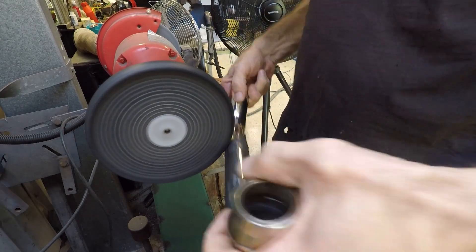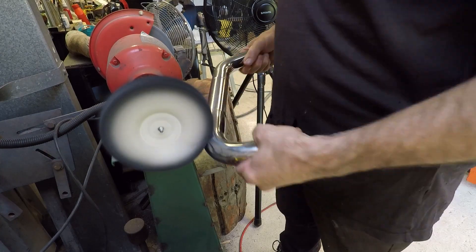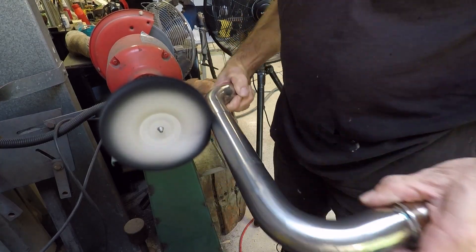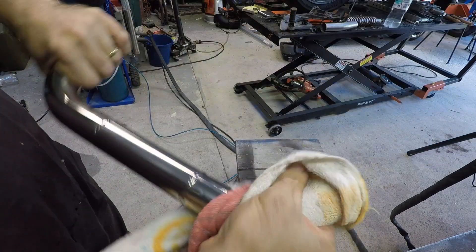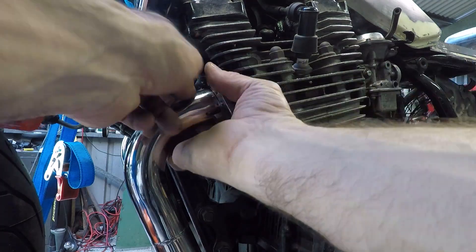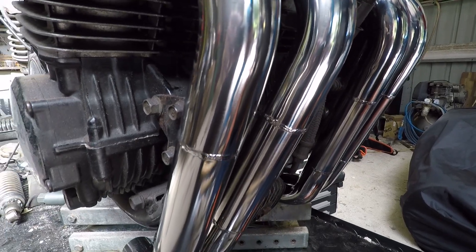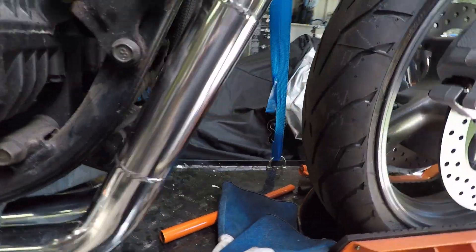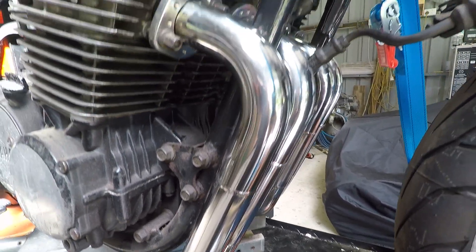Here's one of them — it's turned out as good as I'd hoped with no problems with the weld. I put it on the buff starting with the coarser polish first. The elbows were already polished but the middle section was semi-polished, so a few minutes with the coarse pad then changed over to a soft wheel to get it all matching with a nice finish. I'm suspecting when I get this engine built and running I'll get some nice color out of the tops of those pipes where it's hottest. It's all turned out really well — I'll just mount them on the bike so you can have a look. This is the top section done; I'm waiting on the mufflers I've ordered, so that's all I can do this video. If you like this video please don't forget to subscribe, as it really does help me continue to create videos. The next video will be completing this exhaust system — stay tuned.